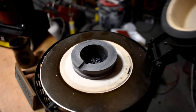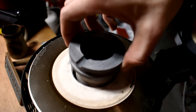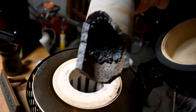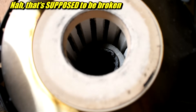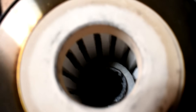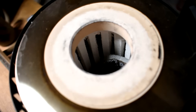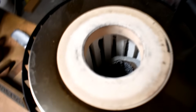So what happened? Well, I was melting a bunch of bronze grain in this two kilogram crucible. As you can see, the crucible had a little bit of a problem. It broke when the bronze was almost all molten and just spilled it into the bottom down in that dark hole. It shorted out all those exposed elements and tripped the GFI. Massive bummer because this furnace works super well, but nothing works super well when it's full of molten bronze. Am I right?